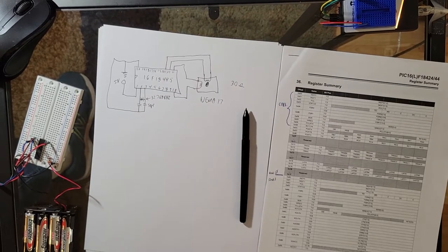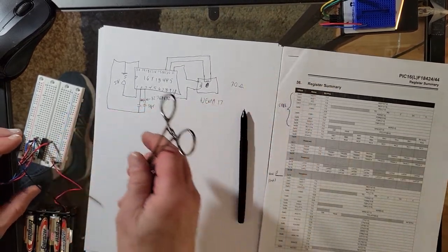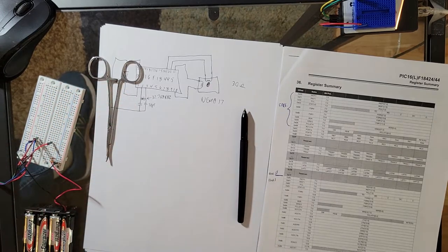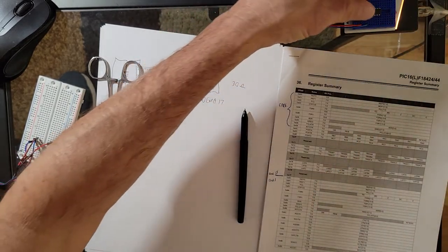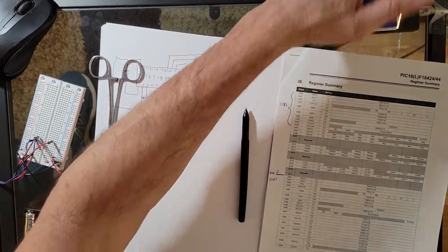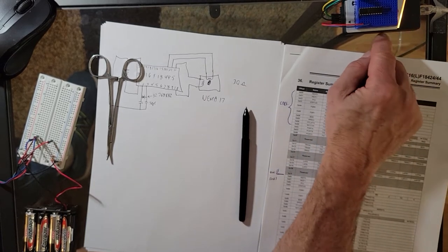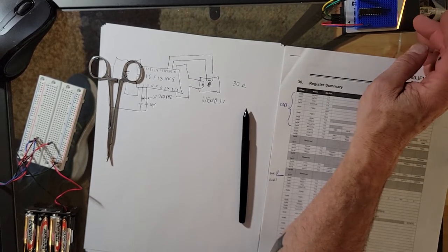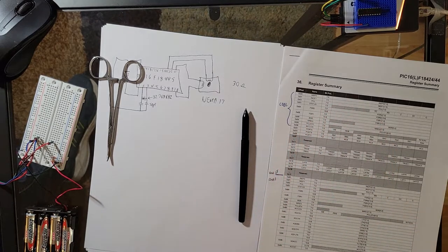Anyhow, let's get this thing programmed up. Let me first pop this chip out of here and put it into my programmer over there. Oh, by the way, I did buy a PICkit 4, as you can see right over here. Honestly, I don't really care for it. It doesn't really do anything different for me. Some people will use it. On the side here, you can put a micro memory card in there, and you can bring this along with a USB port. I'm not sure what you'd use to power it up, but you can power up your project without a computer attached and drop in your program straight from there through this port.